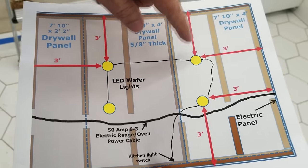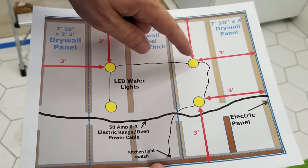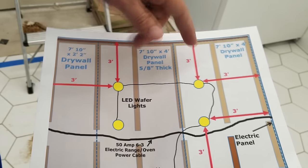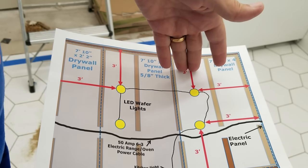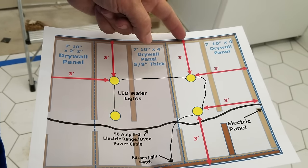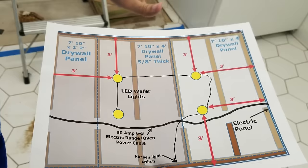This is where a lot of people drop the ball in kitchen lighting. We just went through this at my friend's house — the electrician put a light just inches away from the front of the cabinet. When you do that, it creates too much of a harsh shadow that goes down onto the counter and you'll end up with darkness underneath. The way you overcome that is to have your lights out three feet from the wall, which creates a nice wide dispersion pattern of lighting.